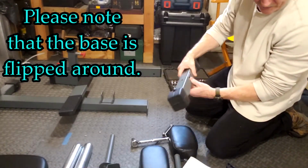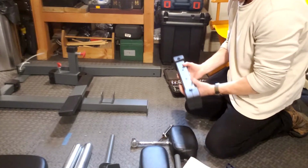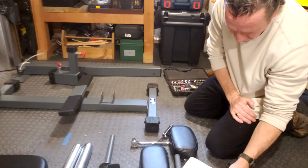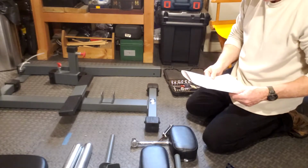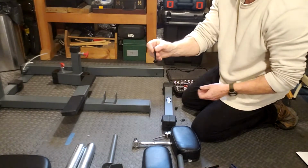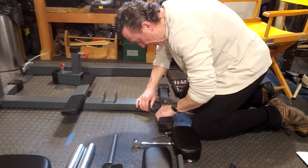So the next step is attaching the front base, number three, to the cross base, which is the bottom frame. I'm going to use the exact same cap screws, they call them. Just line up the holes, and the diagram actually shows how they'll be assembled right here. This has the XMark decal on it, and that will be facing up. I'm just going to run a washer through the bolt, put it here, do the same on this side, put it through here, and then we just have to snake this